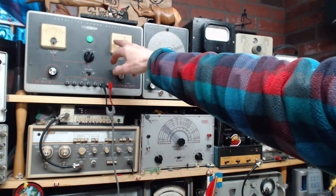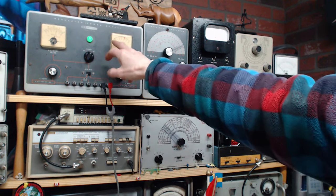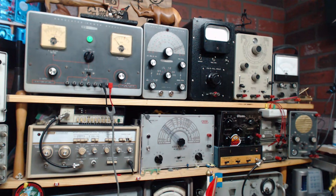It's right down at, this is actually 10 milliamps on this meter, which is quite low. Quite a low current. This is because the tubes are not hot. If we let the tubes heat up, then we would get a very different current response here. But that's not what I'm looking for. I am looking for how much current this thing draws just sitting here. So most of the current drawn here will be through resistors and other things to ground. Some of that could be capacitor leakage. How much? I don't know. I don't know how you even discern it.